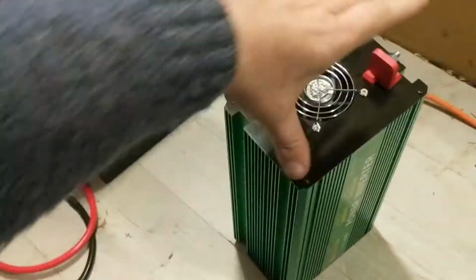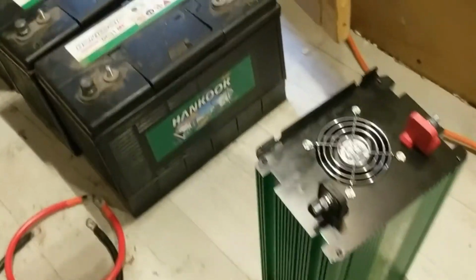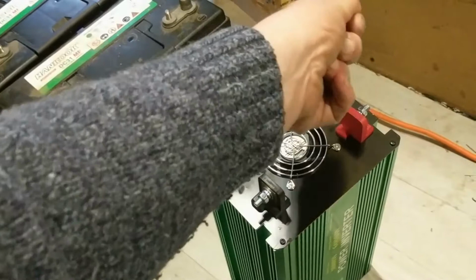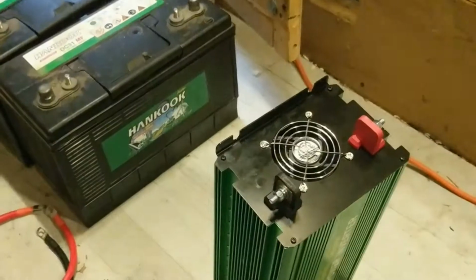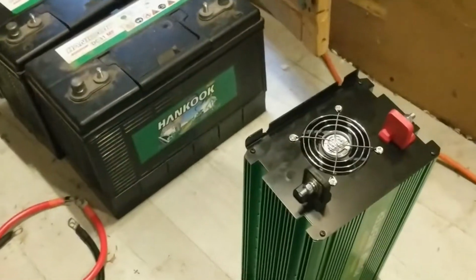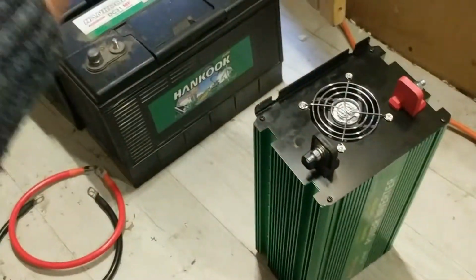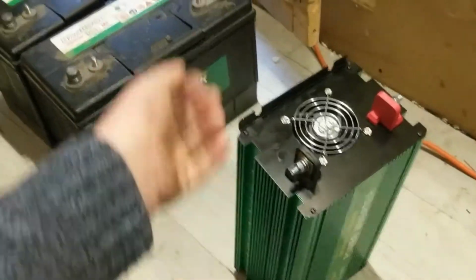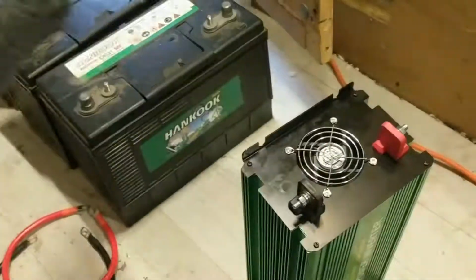So don't just connect this direct to battery. Connect your negative to your battery. Bring your positive to a headlight bulb, and the other side of the headlight bulb to this, and you'll see the bulb will come on and then fade out. It comes on bright because the capacitors are sucking all the voltage through it, and it goes out because once these come up to the 12 volts, they stop taking power, and then you're safe to make a direct connection.